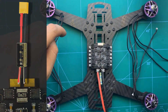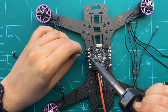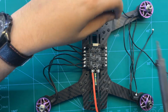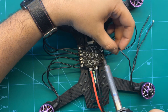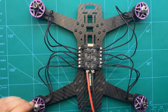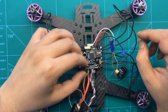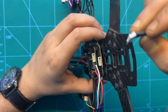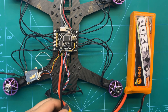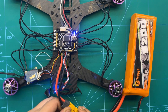The positive must be connected to positive and the negative to negative. We start by attaching the fourth motor to the ESC, then the third, the second, and lastly motor number one. Now all the motors, the capacitor, and the power cable are connected to the ESC. We place the FC onto the mounting board and connect the 8-pin connector cable, keeping in mind the protocols used by the ESC and FC — if they are not the same, we'll have to wire it manually. Once everything is connected, we connect the battery to check it is powering on and hear the ESC powering on the motors.